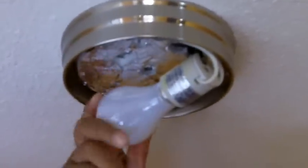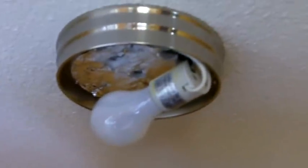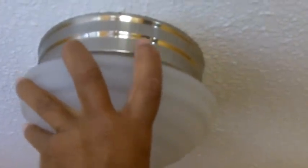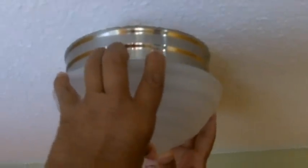Let us put our light bulb in there. Now it is time for the globe — check your instructions because all globes attach differently. This particular one, we insert it and twist clockwise. Let us test it — that is secure, that is up there. Now is the moment of truth. I turned the breaker back on at the breaker panel and now all I have to do is turn it on at the light. It is an easy install. This is Leah saying, you can do this. See you next time!